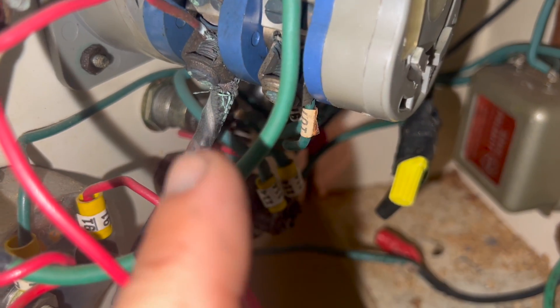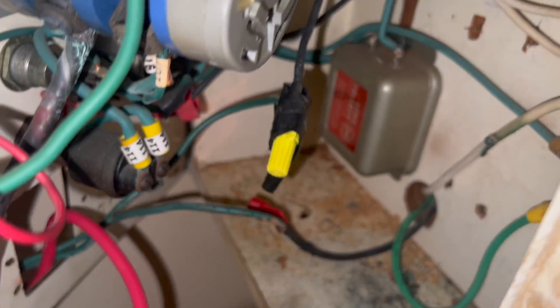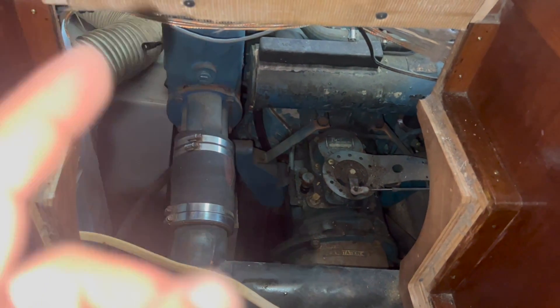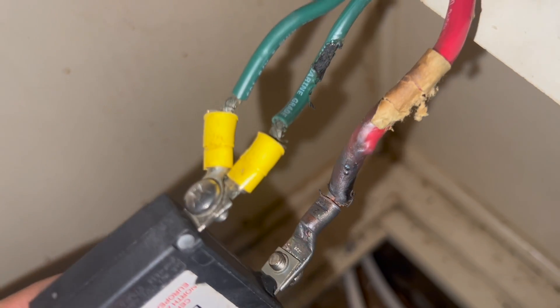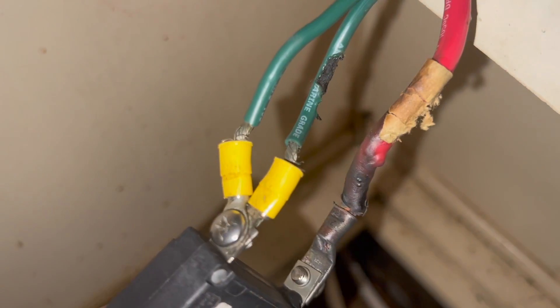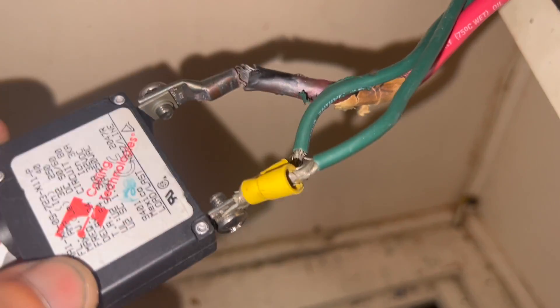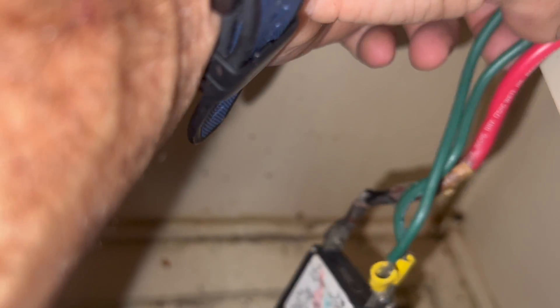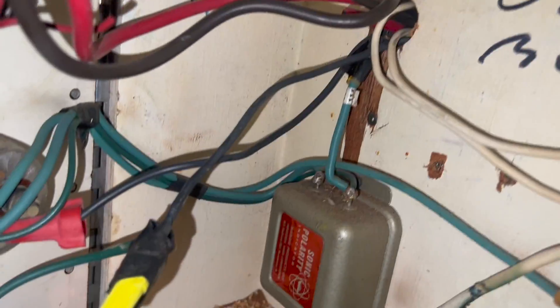You can see that all of this has been burned and melted - this was literally a fire. We've got black to green, to green to black, more red to white to black to green back to red down in the engine room. So it is a menagerie, a cornucopia. Here's the breaker and as you can see this is also just completely scorched and melted, then it was crossed over like this. Look at your green sides, which by the way are the other leg of the hot. The red is your lead coming in from your switching box, and the two greens are going out to the two air conditioners - but you go green to black and then black to black, and then that goes out.